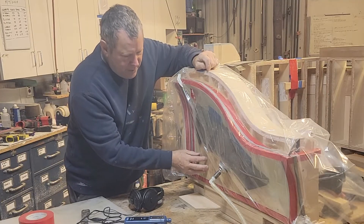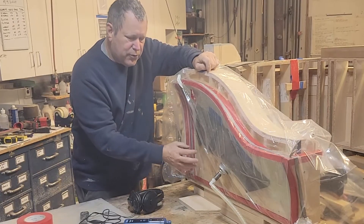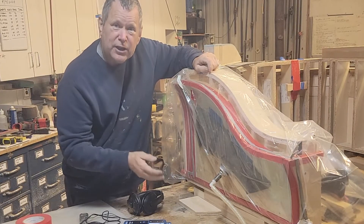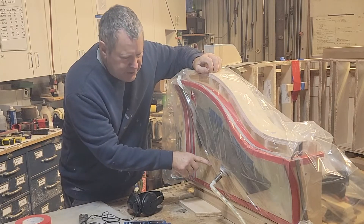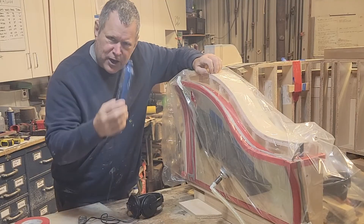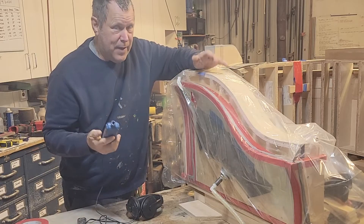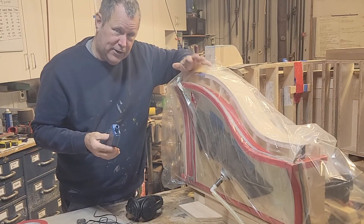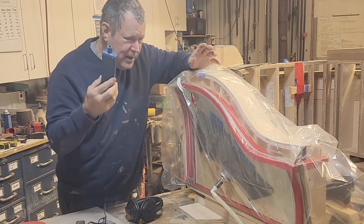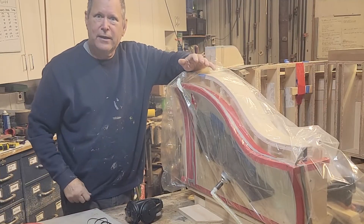I thought it might lose some pressure sucking through the bendy ply, so I had actually sealed that first with a little PVA glue, but clearly didn't get enough to cover that nail hole. So this is a great thing if you do a lot of vacuum bagging — either compound curves or just general vacuum bagging — and you always have that annoying little leak you can't locate. Well worth the money; it pays for itself just in time saved finding the leak.